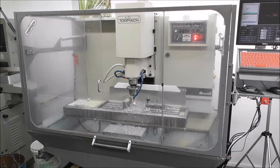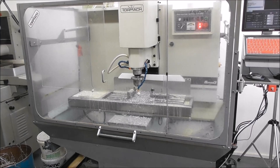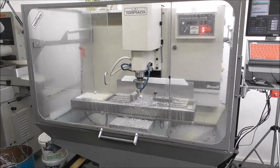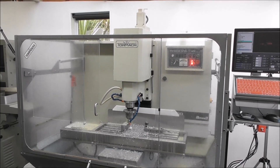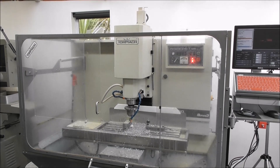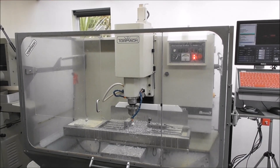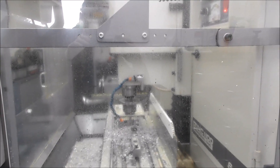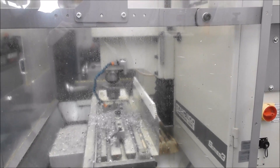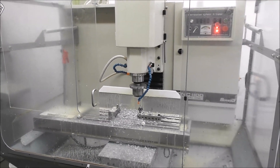Spindle turning in a milling machine is a lot more accurate than with RapidTurn because you don't have to account for thermal expansion in the same way. The feed comes in on the X axis, and the vertical spindle of the mill is free to expand or contract without affecting the relative position between the tool and the part, because the headstock is not located against the base in X or Y. In addition, it's cast iron which has much less thermal expansion, so there are two reasons thermal expansion is less of an issue with vertical spindle turning.